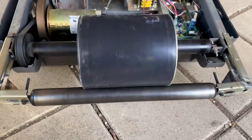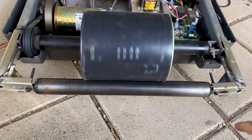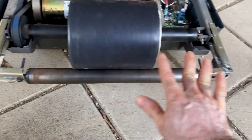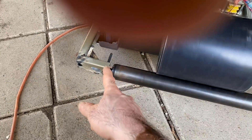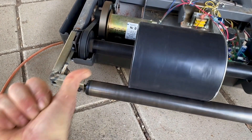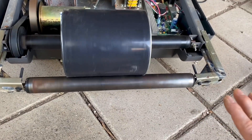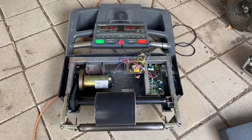A couple of words of advice: when you mount these rollers on the brackets, make sure they're exactly parallel. If they're even a little crooked relative to each other, the drum is going to want to roll to one side over time. Eventually I may need to add a small roller bearing to guide the drum in place — but for now, don't fix what isn't broken.